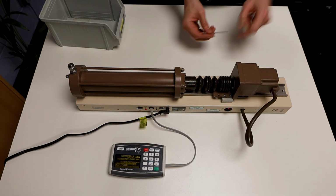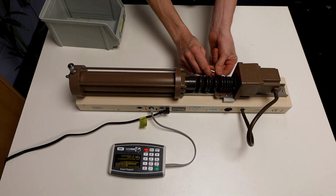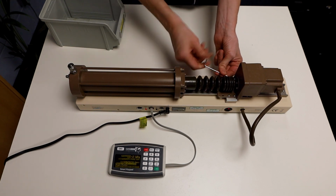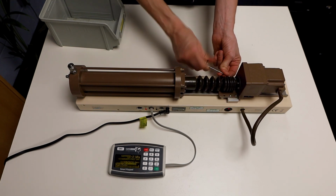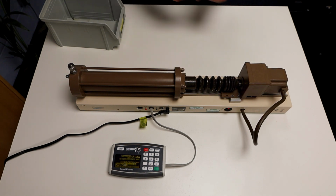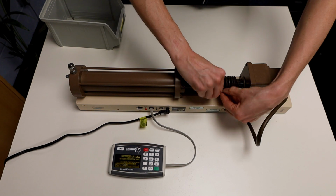While filling, you can use a 2.5mm Allen key to remove the 2 screws holding the bellow plate onto the gearbox. Note though that this particular controller has broken its bellows, and these will need replacing before the controller is reassembled.